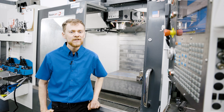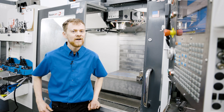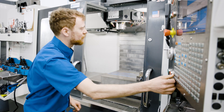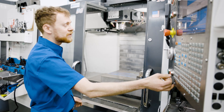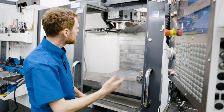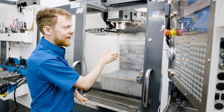If you're having random orientation issues, I would recommend looking at the spindle belts and pulleys, but in this video I'm just going to show you how to reset the orientation. Let's go ahead and run the spindle on this machine. I'm just going to stop it, and now I'm going to press spindle orientate. I can see that it's off — it normally should be parallel with Y and at a little bit of an angle.